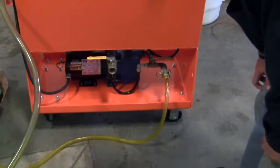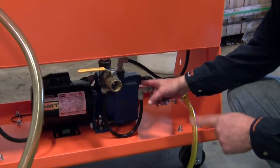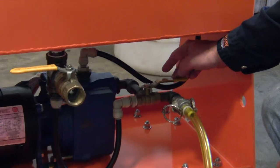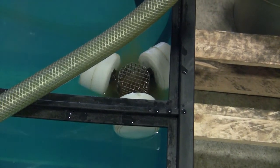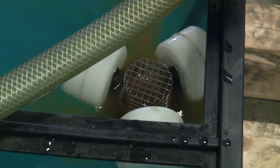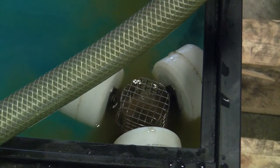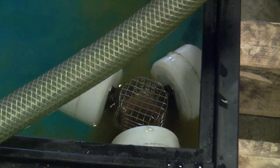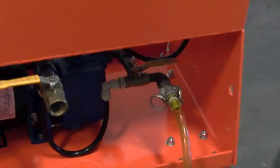This is our electric pump version — it's a self-priming pump, however you have to prime it the first time. To do this, we use this three-way valve. Open it and it allows fluid to come from the tank into the pump cavity, forcing fluid and air out of the pump cavity up into the skimmer. When you stop seeing bubbles at the skimmer, we know we've got the air out and it's ready to go. Then make sure you throw the valve in the opposite direction — now we're ready.